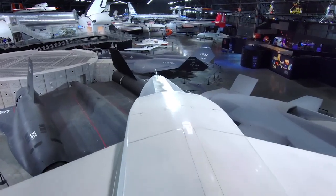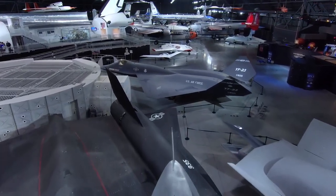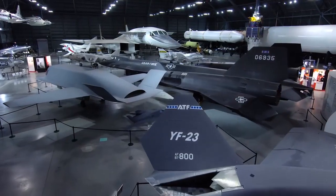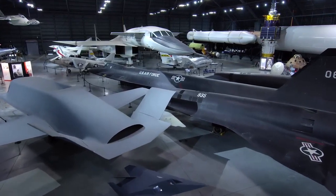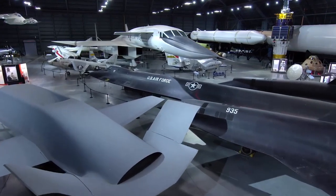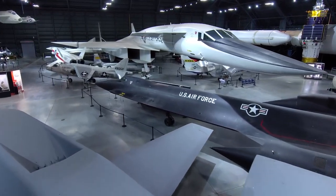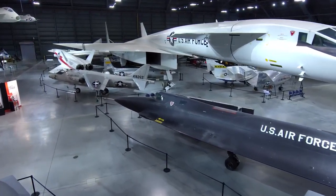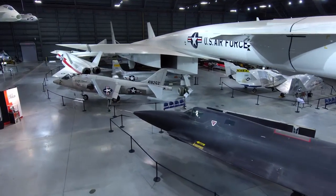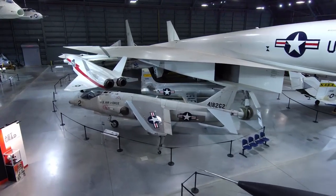69% of the airplane's 150,000-pound weight is this welded stainless steel honeycomb sandwich. It covers the wings from tip to tip, the engine box and the center fuselage, the fins and the rudders, and the forward part of the canards. Most of the forward fuselage and aft plane is built up from titanium alloys.